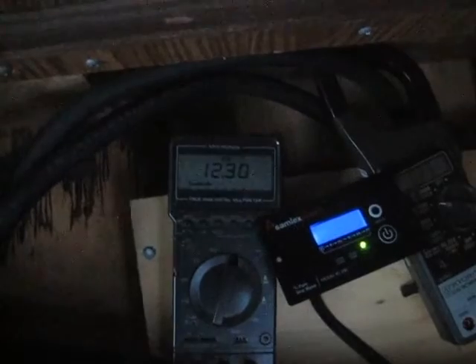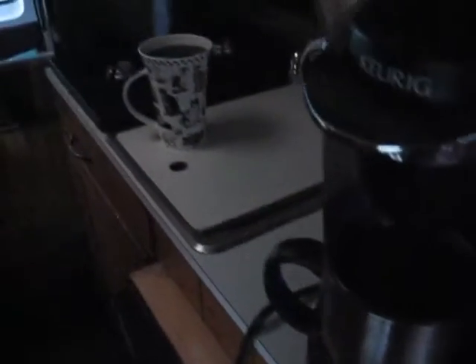Although right now it's not — it's just a resistive element, except right now it's running a pump. The voltage is up where it needs to be and the amps are pretty low. The Keurig is probably 10 amps on the AC when it's running — 60 hertz, 3 watts idle. It looks like we're going to pass our test. The voltage on the battery is doing pretty good — the steady state voltage would have to be tested later in about 3 hours, but it hasn't dropped down too much. And there you go — we've got two full cups, so we passed our test. It wasn't money wasted — pretty happy to see that.